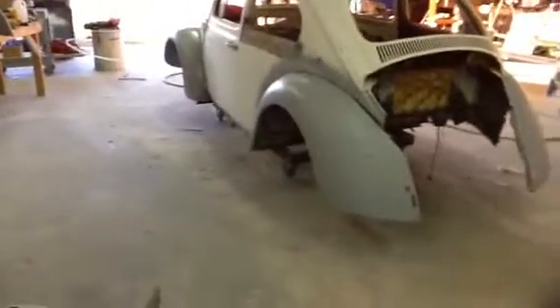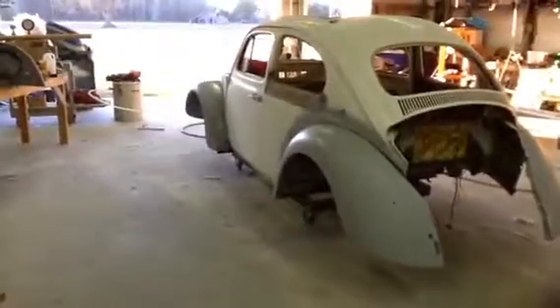Making good progress — finally two weekends in a row. The next step is to sand these down again with 180, and then if we need to do a little bit more primer we will, and then hit it with 320. Then they'll be ready to paint. Yes, I said paint, dude — whoo! Cheers, Zen dog.